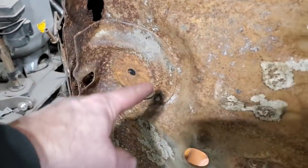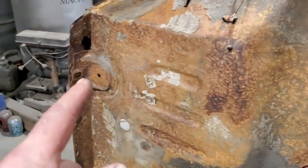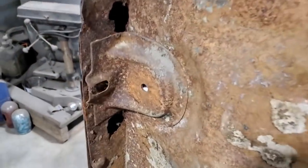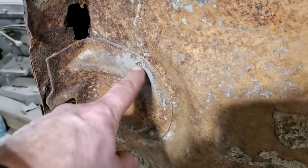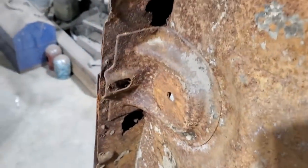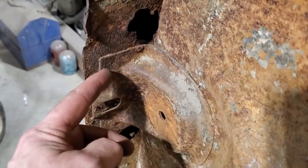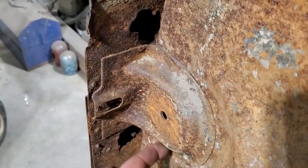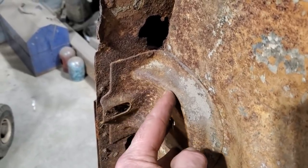Here's a body mount on the passenger side. You can see the way it's shaped. The problem I got is I got needle one over here — there was absolutely nothing there. So what I got to do is make one of these. I'm going to sit down now and show you how I made this mount. Looking at it, you can see this rolls up here — that's one piece. This going around the side is two pieces. And this here in the middle will be three pieces, and I join it right through here.